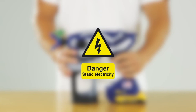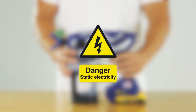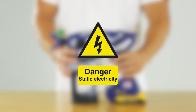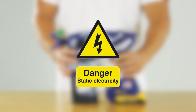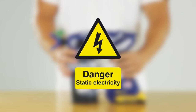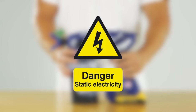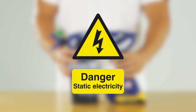If you're spraying oil-based and flammable materials, please be aware that these substances generate static electricity when sprayed. Static electricity creates an explosion and fire risk. Ultramax and Ultimate MX sprayers have a grounding cord that will conduct the static electricity to a grounded electrical outlet. The sprayer and all objects in the spray area should be properly grounded to protect against static discharge, sparks, or shocks.